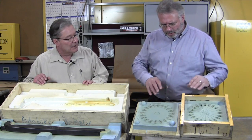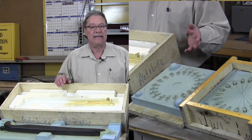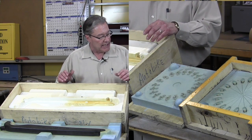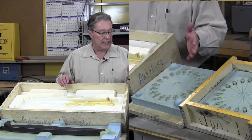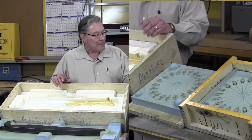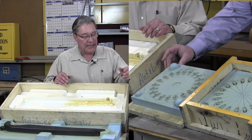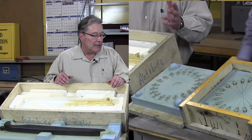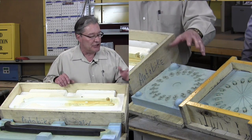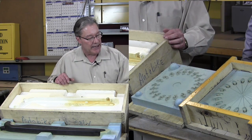What we've got here is an application of a multi-cavity tool. Small parts — the customer was looking to have a couple hundred of these shot, so we did a 10-cavity tool. We can typically get about 50 shots off a tool, so with 10 cavities that tool would be good for producing 500 parts. Both halves on this one are silicone.